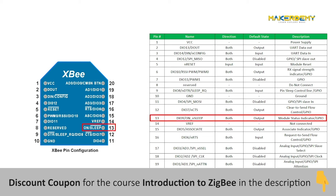Pin 13 is an output pin dedicated to monitoring the sleep status of the device — if the pin is high, the module is on; if low, the module is in sleep mode, though sleep doesn't mean the module is fully off. Pin 14 is a Vref pin, used as an analog voltage reference, which is critical for threshold detectors, reference inputs to analog-to-digital converters, and comparators.